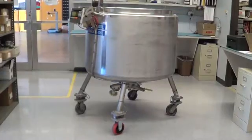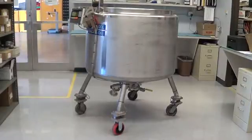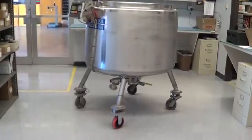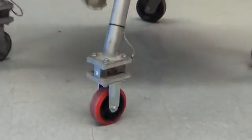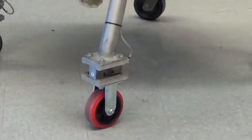This is an example of a portable tank using the Ringstrom caster load cells. They mount easily between the leg of the tank and the caster. The cells are moment corrected for the caster mount to compensate for a swivel caster.